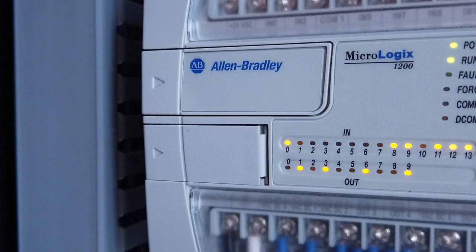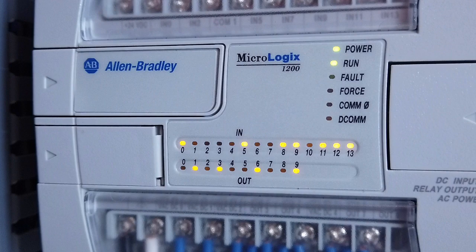Finally, the signal provided to the PLC input has to be present when there is no object detected by the photo-eye. This last verification is important because it will not only confirm that the photo-eye logic and the circuits are working, but also that your AutoHeight selector switch is turned on.